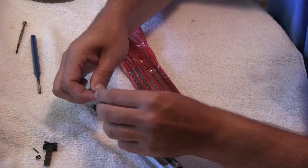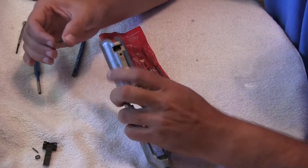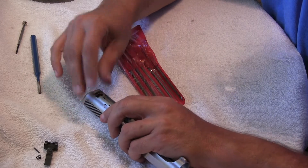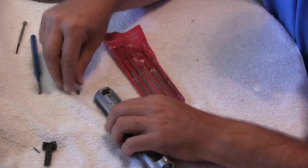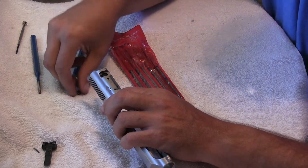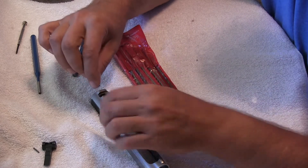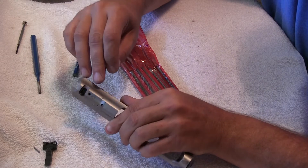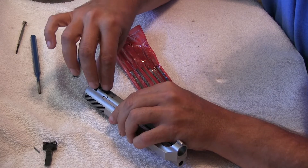The first thing we're going to put in is the tiny spring with the little cap that goes in it — it goes into this hole right here. Just work it in there. The cap goes up because it's going to put pressure on the sight for adjustments. I think this one is actually more to keep the firing pin block pushed down, and this one is to help adjust your sights. You can actually see a little wearing mark with the spring — it goes just forward of the screw hole.